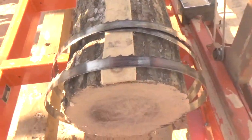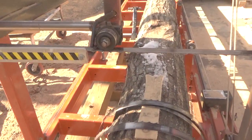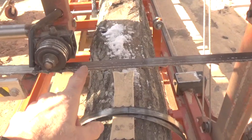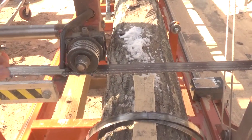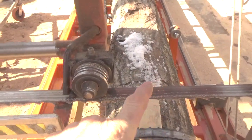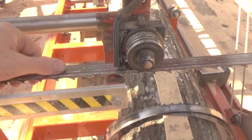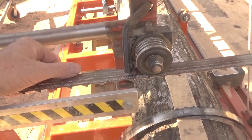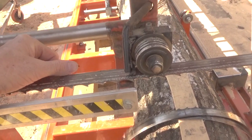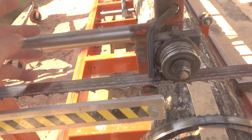Now here's the thing, and you have to realize this in either milliseconds or, you know, slow motion, but what happens here is when the saw hits something, the blade tends to slow down. But because the saw is tight on the wheels and everything, this side, like if you hit something like a nail over here, and this is where you do the cutting, this side of the blade actually wants to bend or weave. It's, for you old timers, if you've ever used a timing light on a car and you've shined a timing light on the fan belt when you give the throttle, you'll see that the belt expands and pulls in a different way at the rear side or the front side of pulleys, actually.